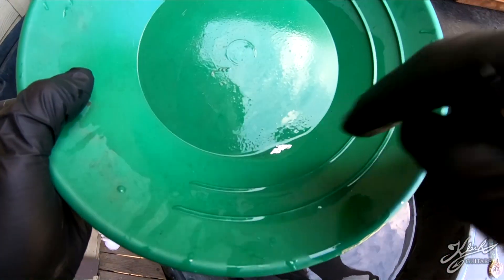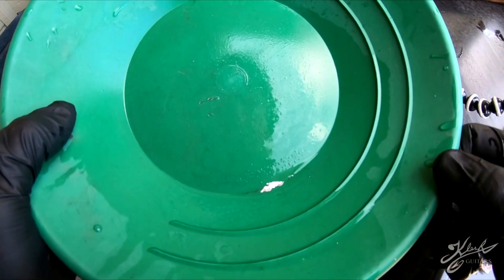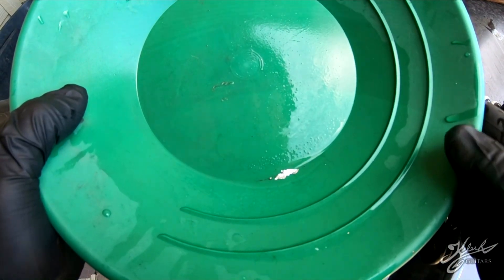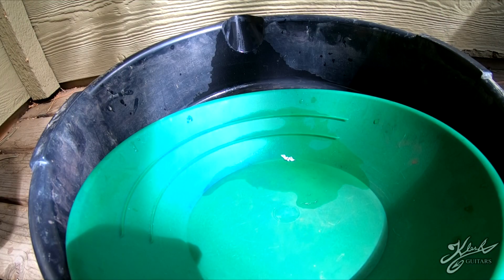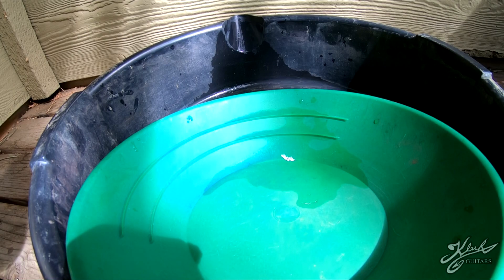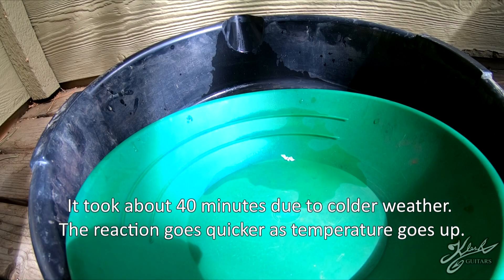That's what's going to get dissolved with the nitric acid, which is the next step. Real quick safety tip: don't do this around people or animals. As soon as I dump the nitric acid onto this blob of mercury and gold amalgam, it's going to start releasing a brown smoke — if you breathe it, you'll be dead. So as soon as I pour this on, I'm going to hit the time lapse and get out of here for about 15 to 20 minutes until all reactions are done.